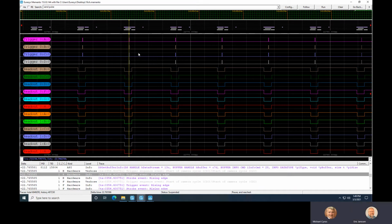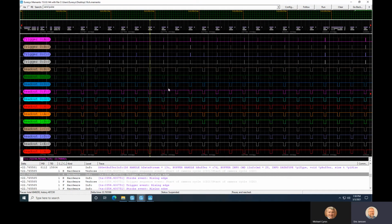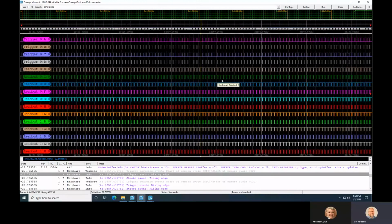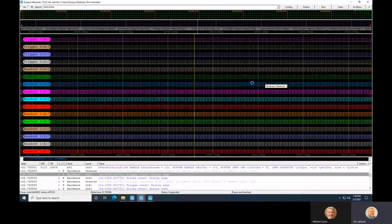In fact, it was 2 octo boards. So it was 1 board with 1 master and 7 slaves, and then a second board with 8 cameras, all of them slaved to the 1 master. So it's a 16-channel, 2 octo board setup compared to the previous one, which was 1 quad. And we can see here that for a very long period of time, all my channels are perfectly in sync. This can then ensure that you acquire all the images nicely all together.